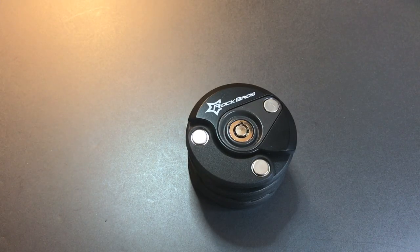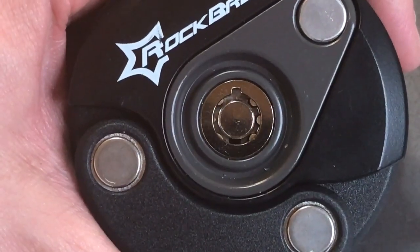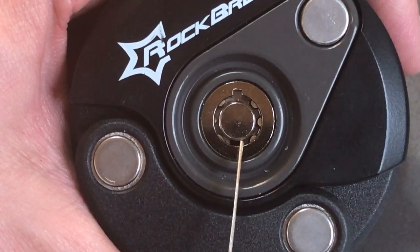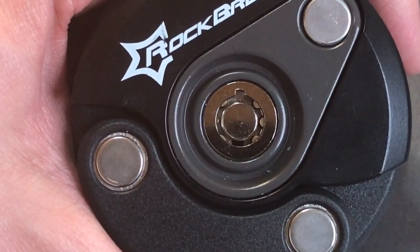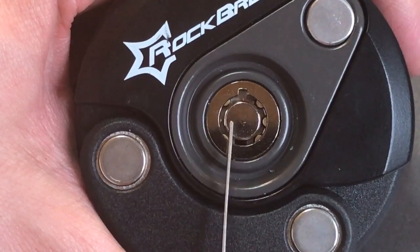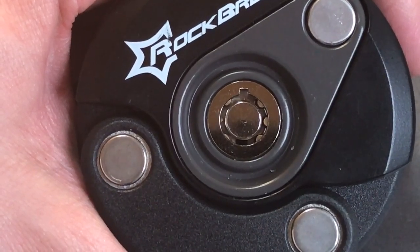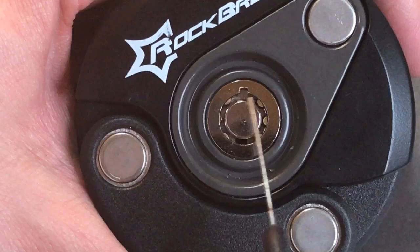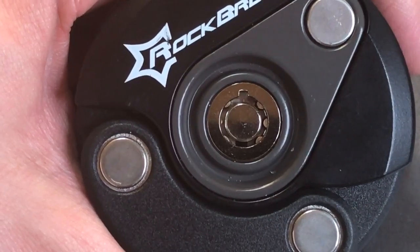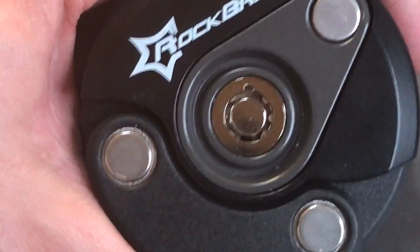Let's talk about what we need to do to pick this lock open. Looking at this core, it looks like a normal tubular lock design with a couple of differences. First, we do not have seven pins — we have six pins, and where we'd normally have pin number four, there's just a hole. Remember that, because we are going to take advantage of that hole a little bit later. Usually we tension the center post on a tubular lock, but we don't do it on this one — that center post doesn't turn at all. The portion of this lock that we have to turn is a ring underneath the faceplate, which is relatively difficult to get to. However, we only have to pick this lock one position, and that opens up a whole bunch of tensioning options for us.